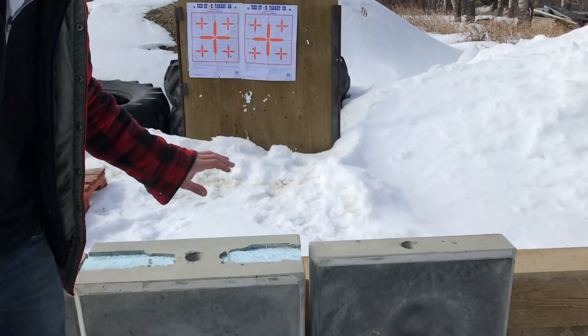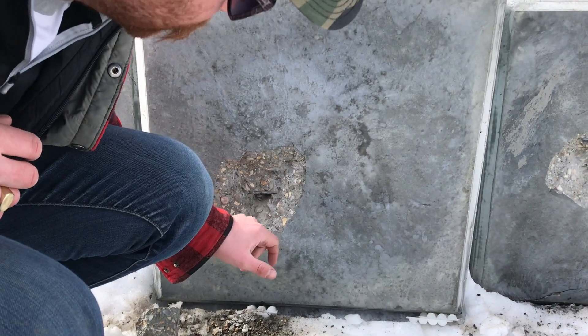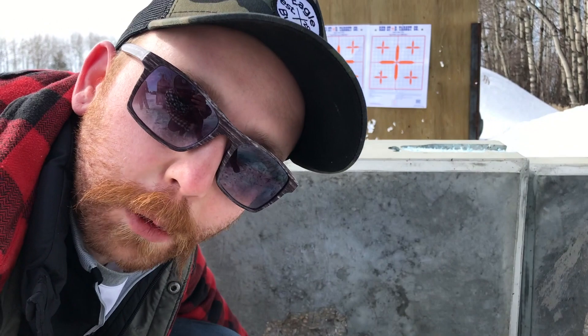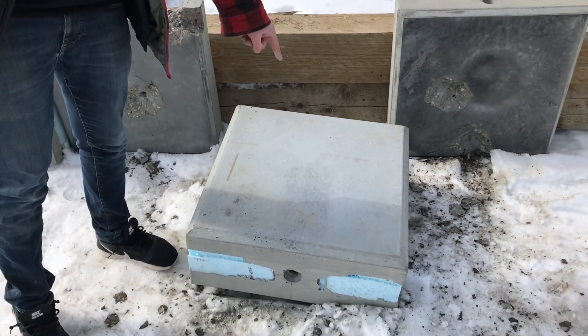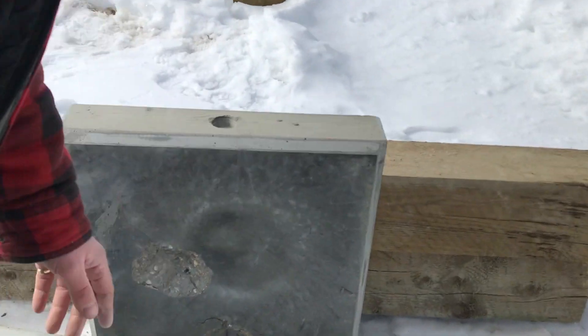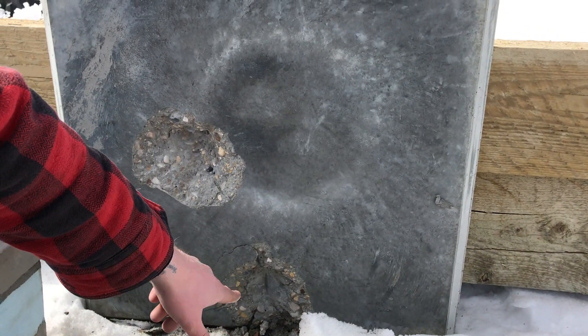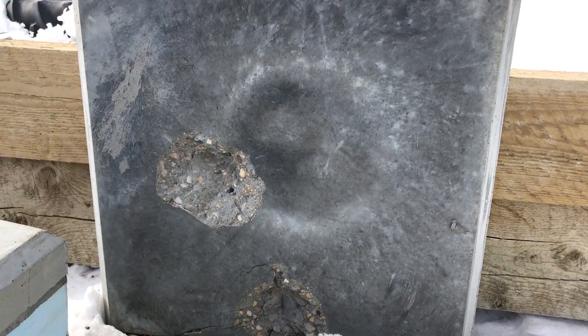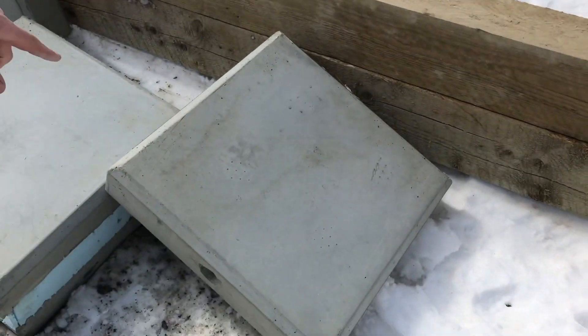What we did here is we hit them five times with armor-piercing bullets using 5.56 NATO. This is the 10-inch insulated panel, hit five times in the same spot. You do see reinforcing here and you do get some penetration, but it did not go through the first wythe of concrete. Hit five times with armor-piercing bullets. There is nothing on the exterior of that piece — did not go through the 10-inch insulated precast concrete panel. The five and a half inch solid was hit at the same location where the 416 Rigby hit, and the 5.56 NATO hit five times. Didn't go more than about an inch in, and again nothing went through it. So from what we could tell with all the tests we did here today, precast concrete wall panels are indeed bulletproof.